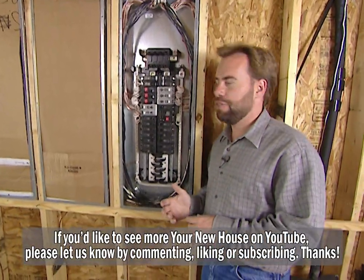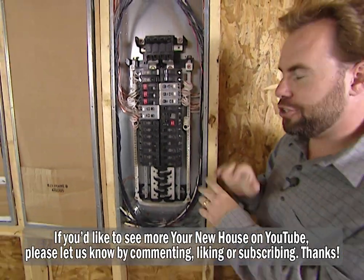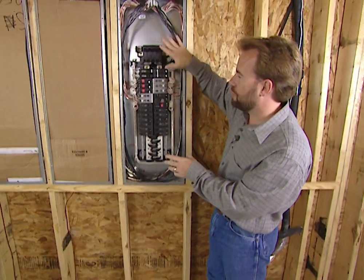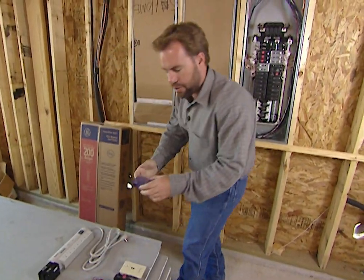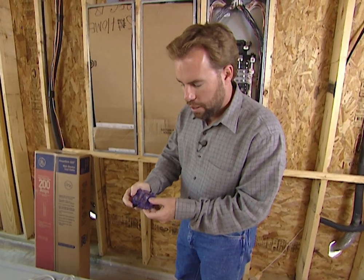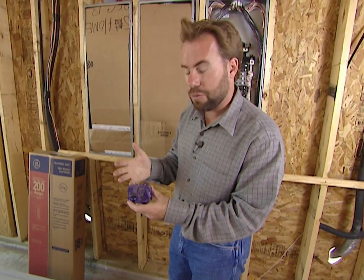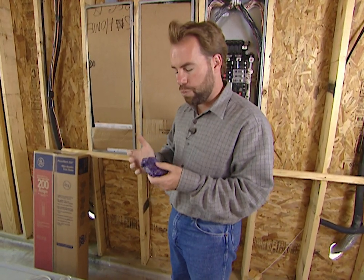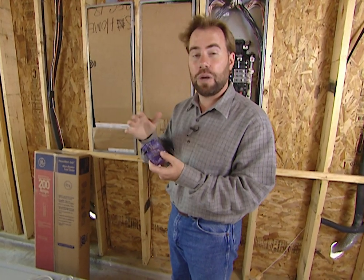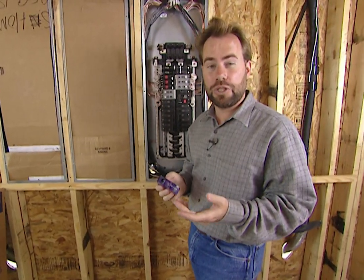You can usually find your breaker box out in the garage of your house. These are breakers inside the box itself, and without the cover panel on it you should not be reaching into a breaker box because you can get electrocuted. Once the panel is in place you can flip your breakers if you need to. This is a see-through version of a thermomagnetic breaker. The magnetic section takes care of short circuits, and the thermal section detects overload problems. If you plug too many things into a circuit it heats up the wiring, heats up the breaker, and trips it, shutting off power so the problem stops right at the breaker box.